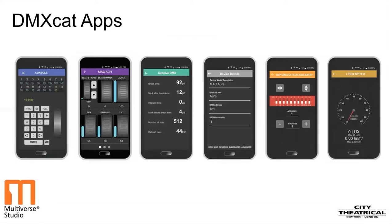The second test and diagnostic tool we include in the kit is DMXcat. By the way, CAT is an acronym for Control, Analyze, and Test. It allows anyone to have a tool they can carry with them at all times that enables them to turn on, test, troubleshoot, and control any DMX lighting fixture. It links to a database of worldwide lighting fixtures and can load the exact controls to operate any of those fixtures. And it contains a powerful RDM controller.